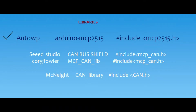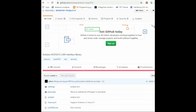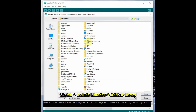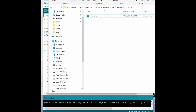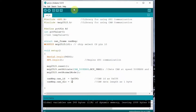Let us see the transmitter code. First, we have to install the library. There are different libraries available on GitHub. In this demo we will be using the Arduino MCP2515 library from autowp. The download link is given in the description below — download the zip file. From Arduino, go to Sketch, then Include Libraries, then Add ZIP Library, browse to the location where you downloaded the zip file, and click Open. The library will be found inside Documents/Arduino/Libraries. You can also directly unzip the folder and copy it to that location. Under Examples you can see the official send and receive examples from autowp, which we will modify to our requirement.